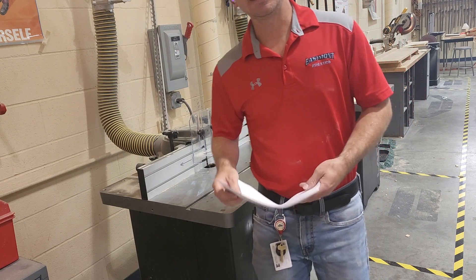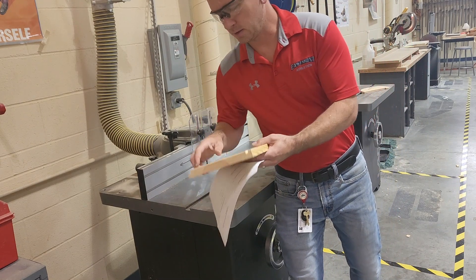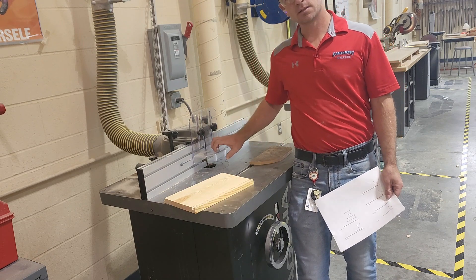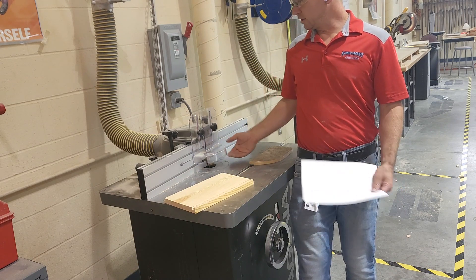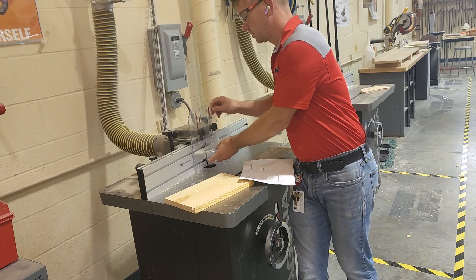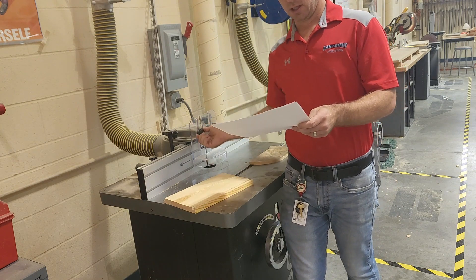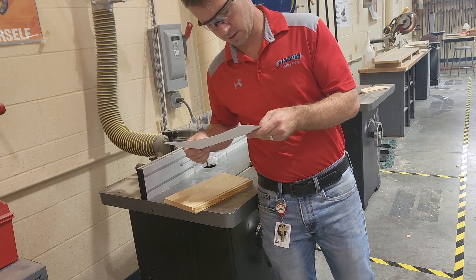Routers are good at making dados — yes, that is true. We've got a great dado right there; we did a quarter-inch dado. I can use the shaper without the blade guard — false; this blade guard should always be in position. If we have a thicker board, we need to adjust the height — we loosen these, raise or lower as needed to get in a good safe position, and get that board underneath. It's best if our hands can't get on top of the board and into the router.